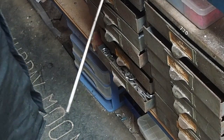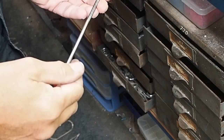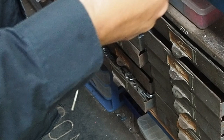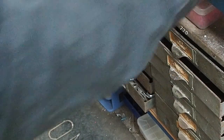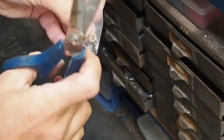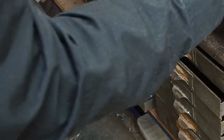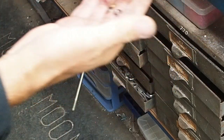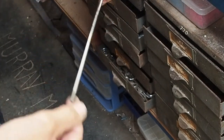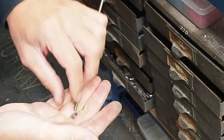Okay, so while that epoxy is drying, I'm going to figure out how much I'm going to shorten my cable by. So I've got the cable pushed all the way in. I'm going to see how much room I'm going to use on my propeller and drive dog and washer. First thing I'll do is chuck a washer on there. These ones I like to use are actually a three-piece washer. Two washers there and a bearing on the inside, like a ball race. So they take quite a bit of room. You've got to cut the cable longer than you would if you were just using a Teflon washer. It goes in the middle, goes that way.